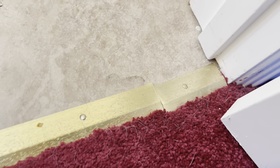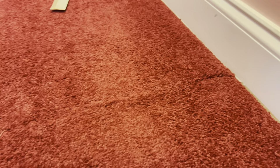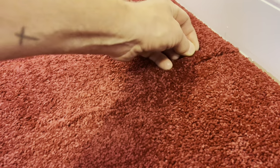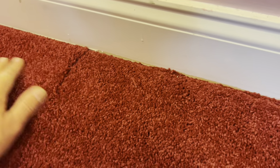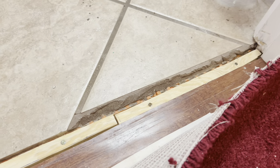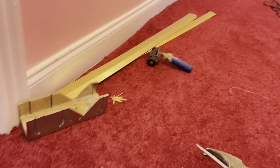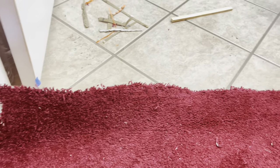This is what I was talking about a while ago — it's a little bit short, that's okay, just put another piece in there, not a problem. What I'm having to do is rip a piece of three-eighths plywood, rip it and stick it in the gully there to have something that my nails will grab a hold of for the flat metal. It just wasn't having any luck — it was too high for the nails to catch without doing that.